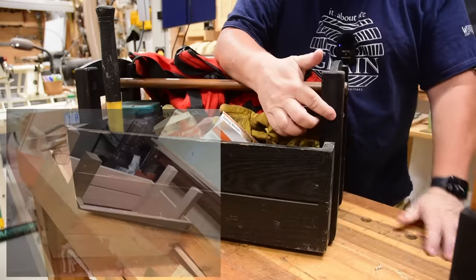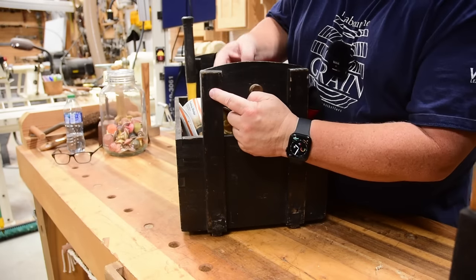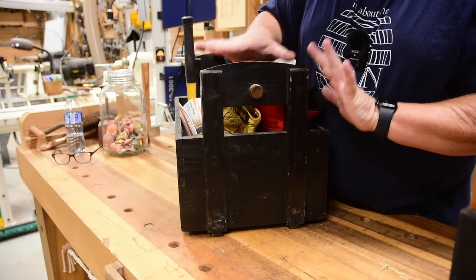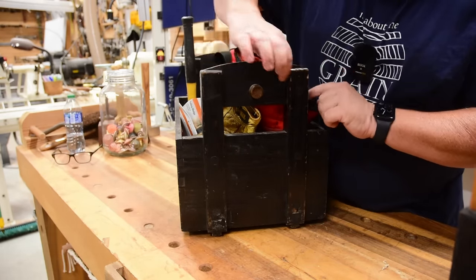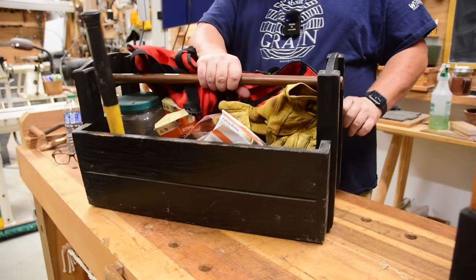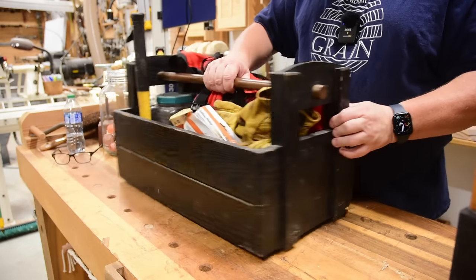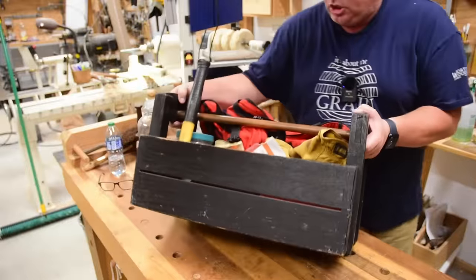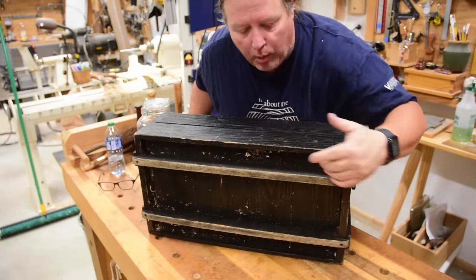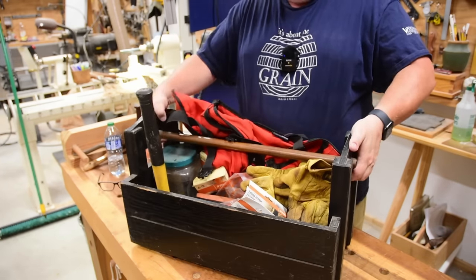The second box has bridle joints on the sides and bottom, secured with oak dowels I made. I found it was a little weak for a lot of the stuff I was carrying — this piece of board split on me a couple times. It's now using a copper dowel with a wood dowel in the middle and copper fittings on either side to clamp it. The bottom is just slats screwed onto cross beams, open and very straightforward — basically all dovetails and bridle joints.